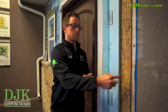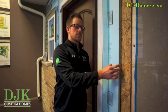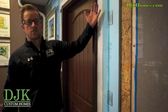Here is where the biggest difference between our wall system and much of our competitors' wall systems are. A lot of the competition is preaching the 2x6 wall system — 2x6 studs filled with typically fiberglass and then just OSB sheathing on the exterior. The problem is there are a lot of moisture problems. What we do is a 2x4 wall system and then we add an inch of DOW foam to the exterior to prevent thermal bridging. We also have a DOW house wrap, which basically protects from the elements — although it's not completely necessary, we feel it's an extra layer of protection.